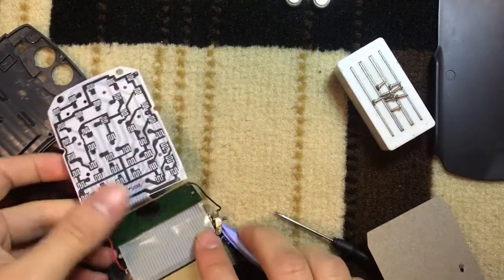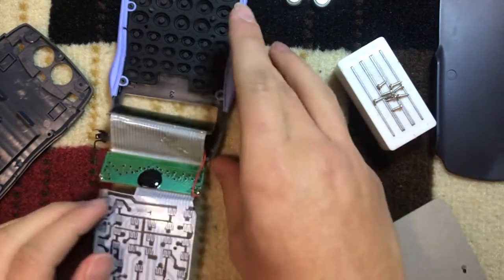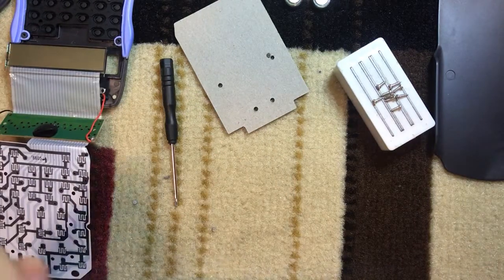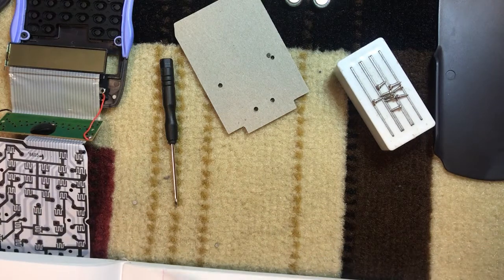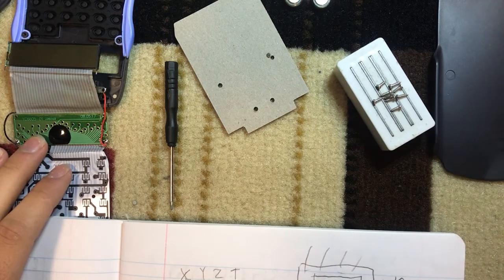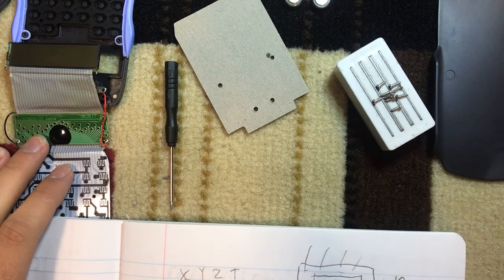And there are some numbers on the circuit board. So first off, the color of the IC package is different. It's actually black. This one, it's like green or something. There's also numbers on the circuit board. Let me write that down. So the numbers are YC, although that's not exactly a number, but YC6605/01. And then in smaller letters, there is JJ6249. And then what appears to be a date code, it says 08.05.17.